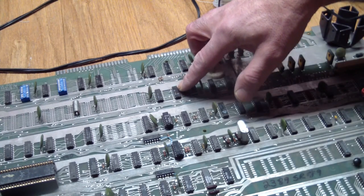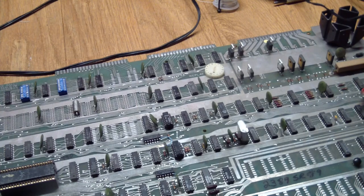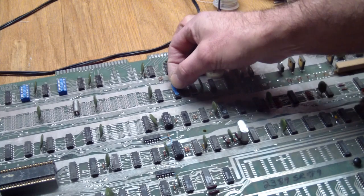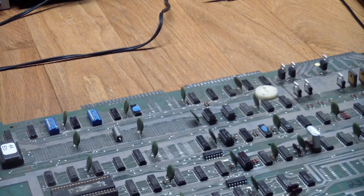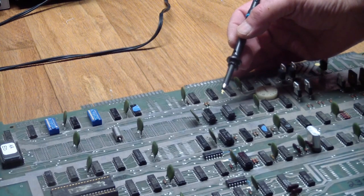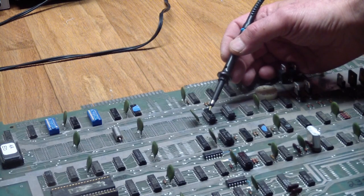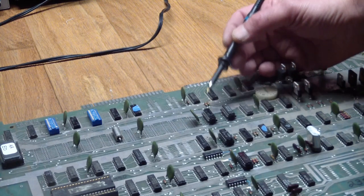Make sure we get the right one — it's E10, which is this one here. One of the important things before removing it is to mark the offending chip, especially since its neighbor is the exact same type. We'll mark it, take it out just like before, and see if that makes a difference. After replacing the chip, it does work correctly now. But poking around further, I found the chip next to it — also a 7414 Schmitt trigger inverter — wasn't working either, so I replaced that one too.